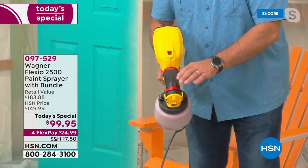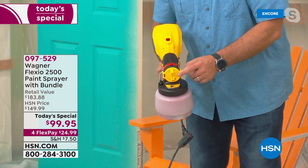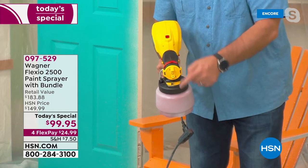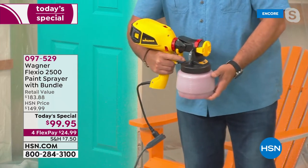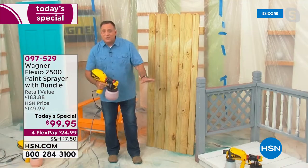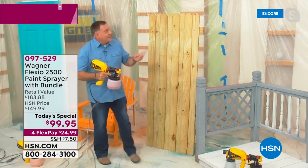This switch right here actually controls how wide or how narrow the spray pattern is coming out. And then this last piece on the front — I always call it the dog ears — because whatever direction it's facing is how you're painting. Right now I'm horizontal; I flip it like that and now it's set up to go vertical. All the spraying is done by pulling the trigger here, so it's on-demand spray. It doesn't just flow the minute I turn it on. When I turn this on, nothing comes out of it until I pull the trigger.